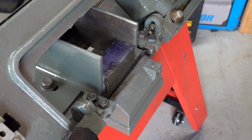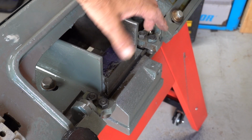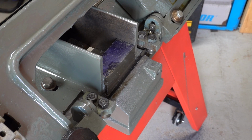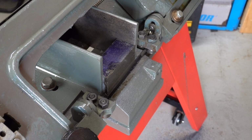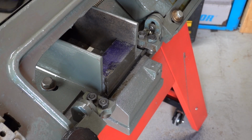Don't pick it up then. So I brought this blade guide back so that there wasn't a lot of distance between the blade, obviously for more support, and it was cutting great. And then I got a phone call and I went out talking to my mate outside, and what I didn't realise was I'd moved this too far this way, and one of the bearing guides was sat on the back of this fixed jaw, and it won't cut in. And for the last quarter of an inch I was thinking it's taking its time. I checked the blade and put it on a higher speed. I tried all sorts and it made no difference. And then I realised, what an idiot. So I've moved the guide back and whooshka, cut it straight away.